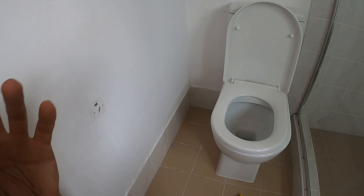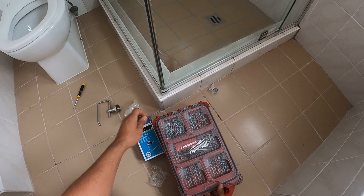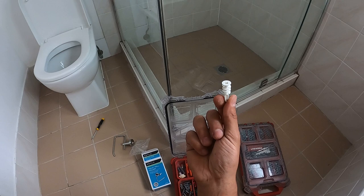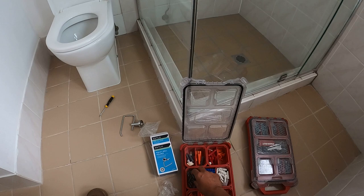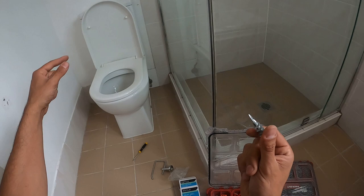In order to create our hole we have to first pre-drill it. Because it's a cement board, the plugs I always tend to go for are these ones here — they're called wall mates, little white plastic plugs. These work very well for plasterboard, however when it comes to installing onto cement board, you can use these ones here instead. It's basically a metal version — you can get through soft timber with these as well. We might still need to create a pilot hole first and then screw this one in afterwards.